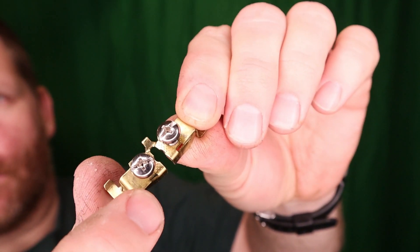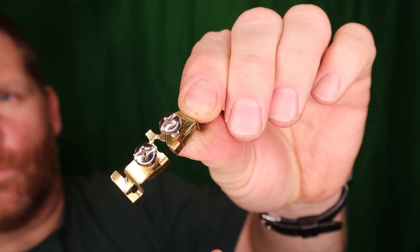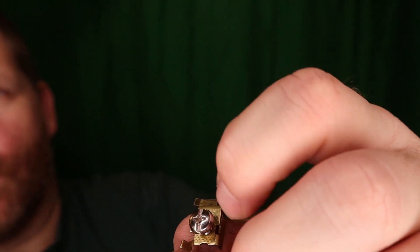If you look real close here, under the screw there are little ridges. When the wire goes on there it has friction to it and it stays tight. That is my reasoning behind it all. I will never — even in a temporary situation — push wires in the back. I've seen people say 'I have two wires under my screws already and I stuck another one in the back because I ran out of room.' I would tell you at that point: make a junction in the box, run one neutral or hot out to that screw, and be done with it.